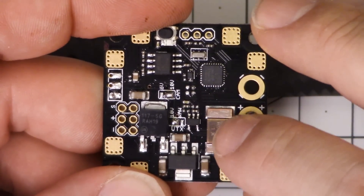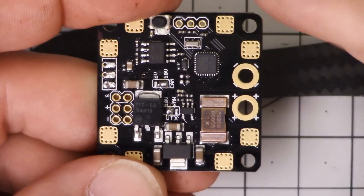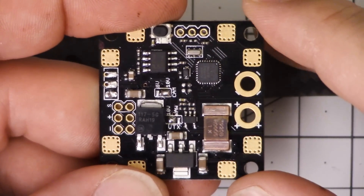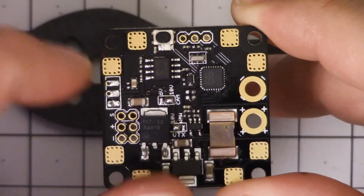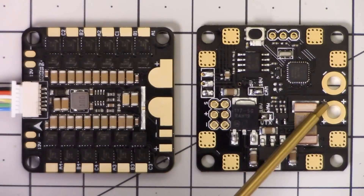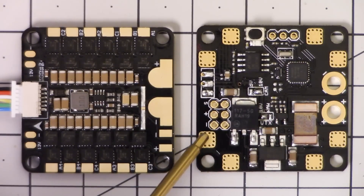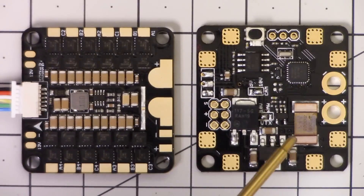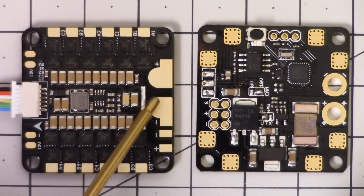The problem is that in order to make that work, you have to have the current coming in on the main pads and going out on the ESC pads. With the RedRotor RROSD V1, there was one big ground pad and one big positive pad on the side of the board, and people hated that — they really wanted separate pads on the corners so you could wire ESCs straight to the corners. But in a case like this with a 4-in-1 ESC, it actually works against us. You'd need to wire the main battery lead in, flow through the shunt resistor to the ESC pads, then wire one of those pads over to the 4-in-1 ESC input. These little pads are not sized to carry the current for all four ESCs.